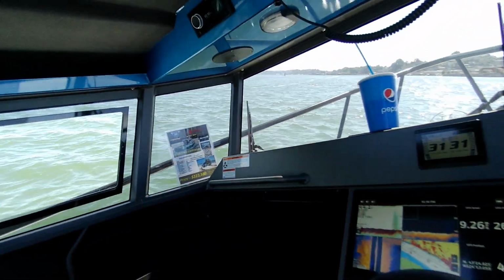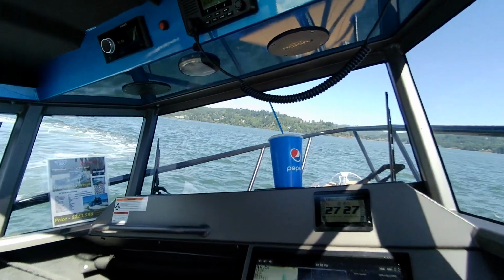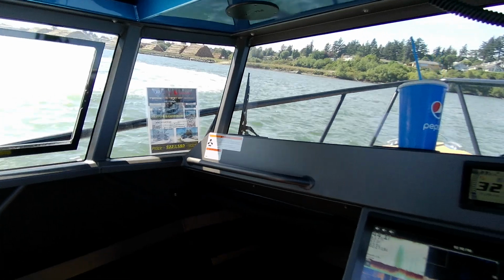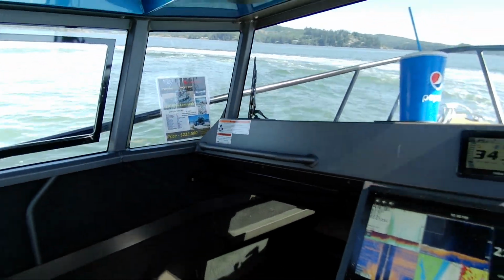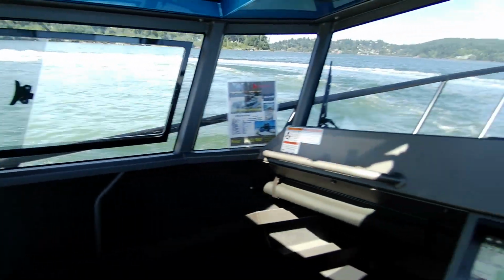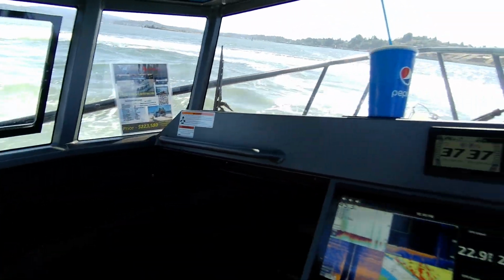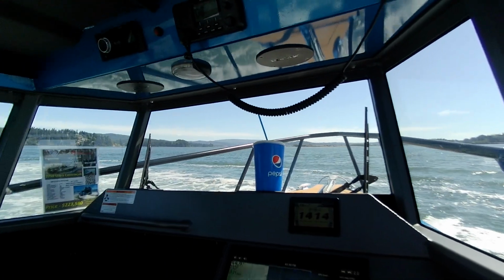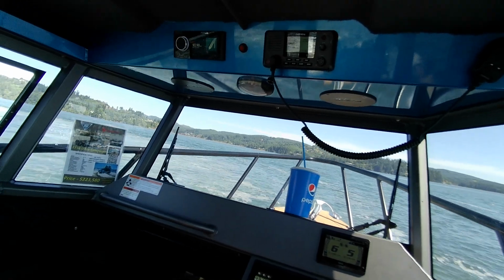Trim tabs all the way up. I'm going to trim tab that up a little bit so it doesn't lean. Look how fast this sucker turns without blowing out of the water. It'll tear you, it'll throw you right out of that seat. So in reverse, I'll bring that tab up. Same thing. Then I'll bring this back. Put it in reverse.